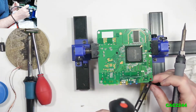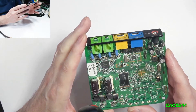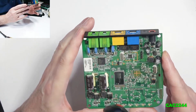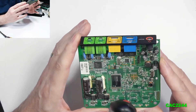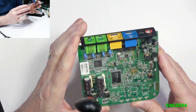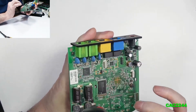After that, what I did was verify for any sign of physical damage, a short circuit, anything blown, or signs of physical stress on the board. I put my magnifying lenses on and I couldn't see anything. So what I did was replace the four capacitors that are on the board.